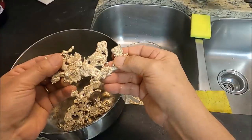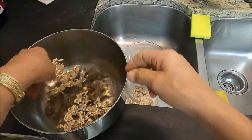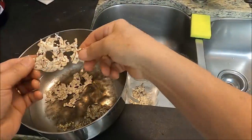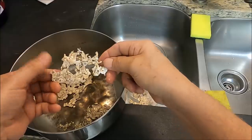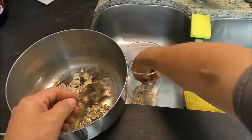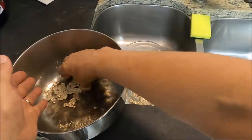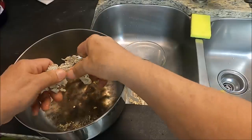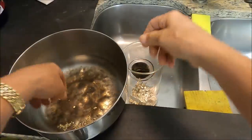We've added additional silver to get the gold content down to around 25% or 6K. Then and only then will we be able to successfully use nitric acid to get all of the silver we added, plus all of the copper and silver and zinc that was already in the 14K scrap — it will come out too. In fact, after I get done with these nitric acid treatments, this gold will be very very close to three-nines fine without any further refining required. That's how good inquarting and parting with nitric acid is at cleaning gold — it's just incredible, but it's counterintuitive.